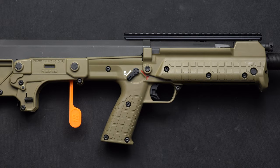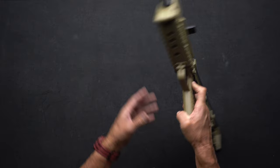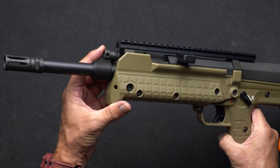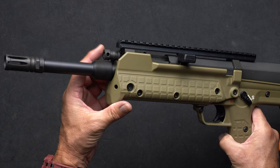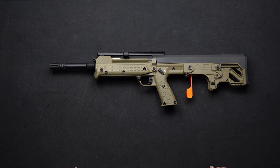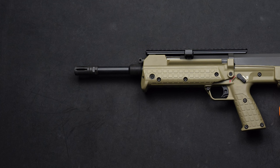Just above the grip and trigger is your ambi safety and also your middle assembly pin. On top here we have the picatinny rail system for mounting optics and accessories. On the other side here, this is your charging handle — it can easily and quickly be moved to the other side of the gun and we'll show you that a little later. Just in front of your top picatinny rail is your gas regulator, and below the regulator is a set of threads for an accessory that we sell on our website. Lastly, the business end has the standard 5/8-24 thread pitch for mounting a compensator, brake, adapter, or suppressor wherever it's legal.